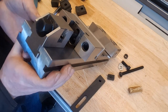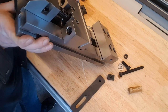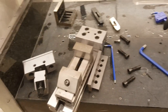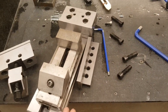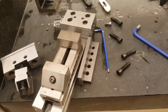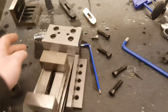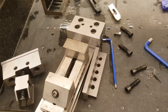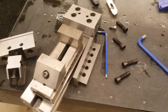The machining inside, it's not that pretty, it's very rough. So I guess that part is not a critical one. I was trying to install the vise in the machine, and I ran a dial indicator on that edge to make it straight, and I did make it straight. And then I thought I'm gonna see how straight my machine is with this, and then the indicator starts going nuts.